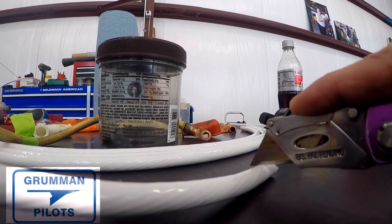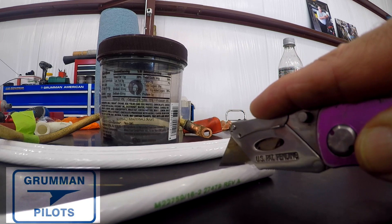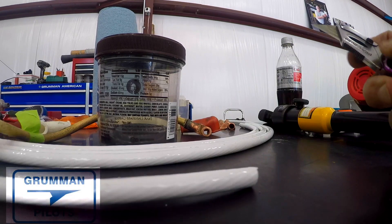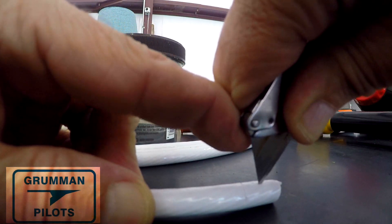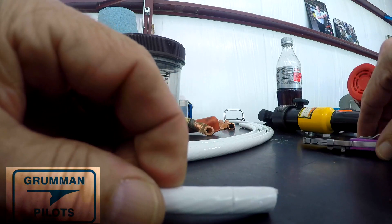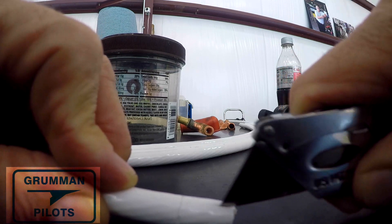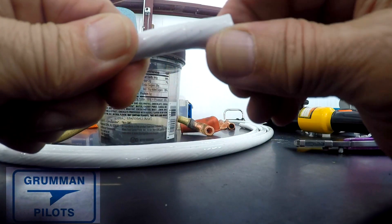The tricky part on this cable is you take a good sharp razor knife and roll the cable on a tile or flame-proof surface, just trying to score down — you never want to feel like you're hitting the cable. Roll it like that several times so you can control the pressure and feel it cutting into the Teflon. When you get it all done, guide the knife right to where you cut and then out to the end to get a good score all the way through. That's not going to affect the strands because they move out of your way in that direction. Then you find your spot again with the razor blade so you're not making a second cut, get it all open, and peel it off.